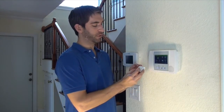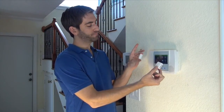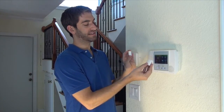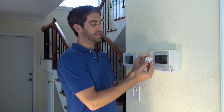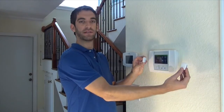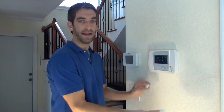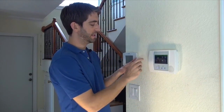The 5814 consists of two items: your sensor and your magnet. On one side of the sensor there's a little triangle which designates the side that the magnet should be on. When the magnet is touching the contact, the zone is happy. When the door or window opens, the panel would fault and cause an alarm if it was armed. So we're going to show you now how to program this and learn it into the system.